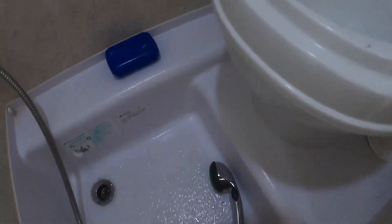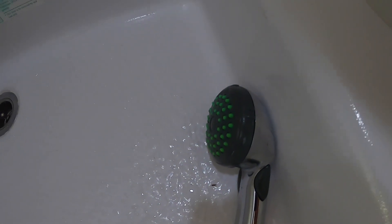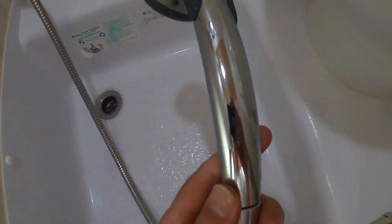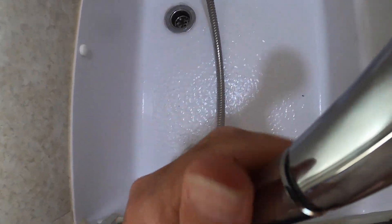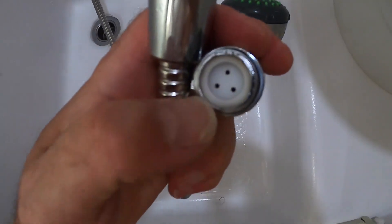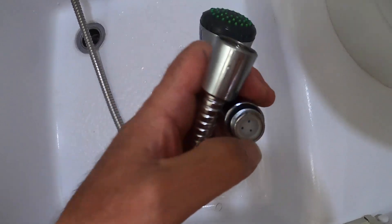Here's the other tip. This is my shower, and it's just sitting on the ground. I'm going to open the valve here. You hear how a little bit of water comes out. What we're going to do is unscrew the head. In the head, see those little dinky holes? That is a volume restrictor.